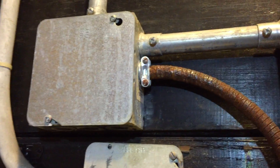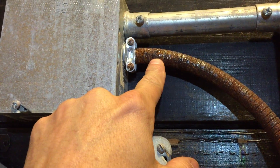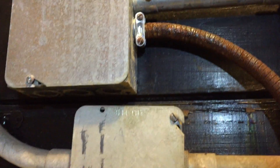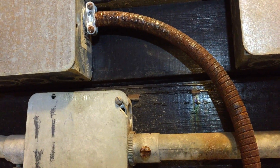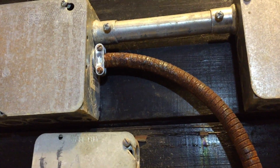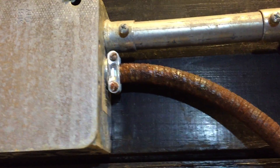In this video I want to take a really close look at the corrosion on this flexible metal conduit. Everything else seems okay — the boxes, the pipes, and the covers — but all this flexible metal conduit is extremely rusted, every piece of it. This would be a violation of Section 300.6, since raceways, boxes, and fittings must be made of a material suitable for the environment where they're installed.